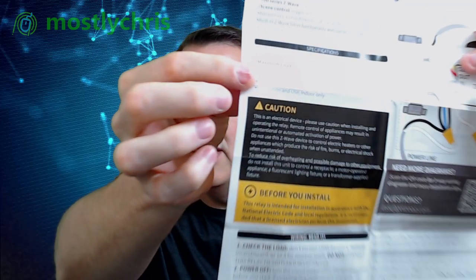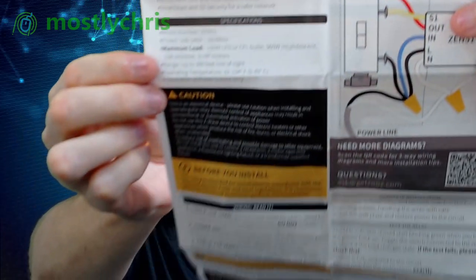What other specs can we talk about here? This relay supports group one with up to 5 devices for lifeline communications and group two with up to 5 devices. It will send basic report and switch binary report to group one and basic set command to group two when operated manually from the wall switch. You can send stuff using the wall switch to the Z-Wave network. You can set direct association to have the relay control another Z-Wave device independently of the hub by using group two, and that just depends on your setup there. Some more specifics on it, and it talks about those here right on the front of the article if you want to read those on the article itself.